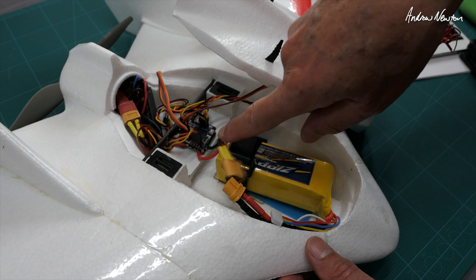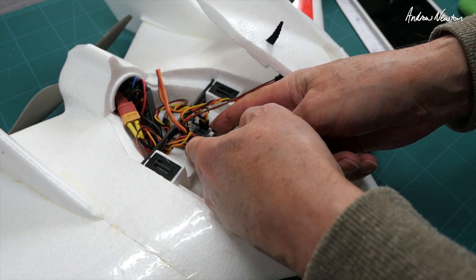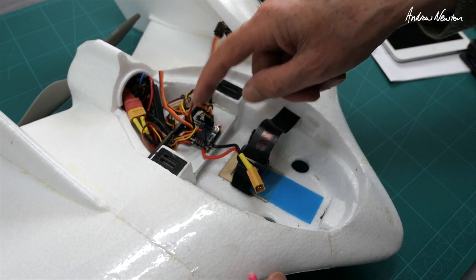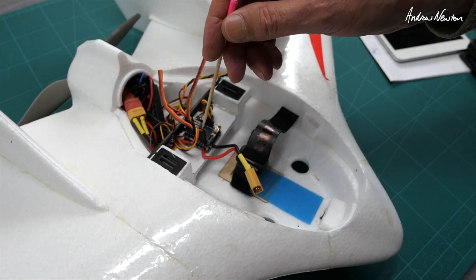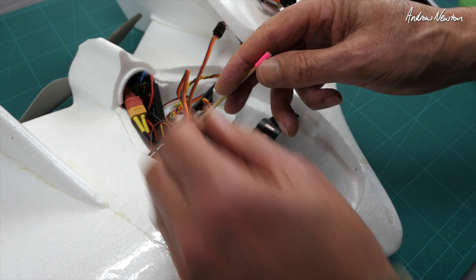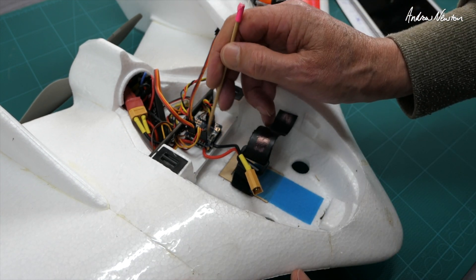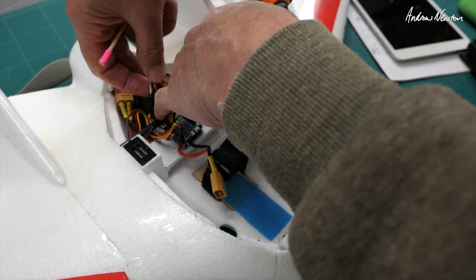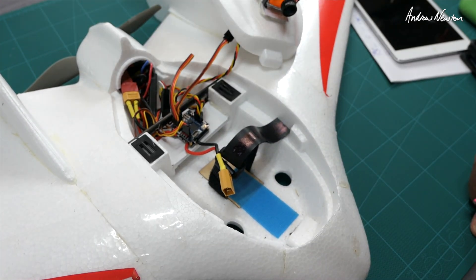I have it sitting here on a little bridge. Nice, neat, compact little size. Servos are plugged in over here. We have the camera and video transmitter here. GPS here which is underneath the wing. SBUS is out in the other wing. I put a little bit of epoxy to support the USB port — that's a little bit fragile. And a little ESC connector soldered in underneath. Lovely neat little board — let's go out and take it for a fly.